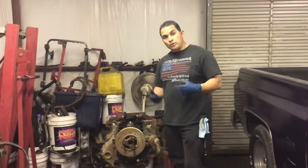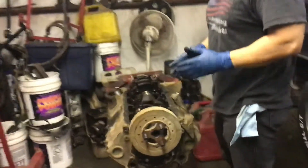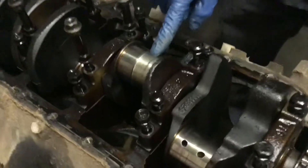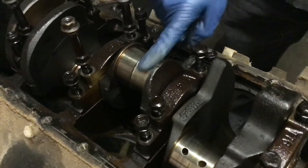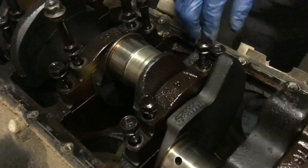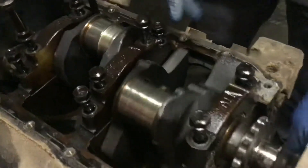Come over this way and I'll show you the crankshaft — which part is damaged and which part is good, so you can see it yourself. Down here you'll see this damaged part. This is a major groove; this crankshaft is no good anymore. This is how it should look — and this is a major groove. You couldn't machine this any further down. It's done, it's trash.